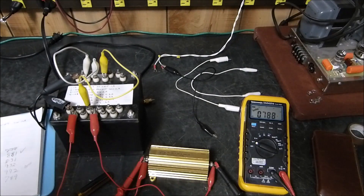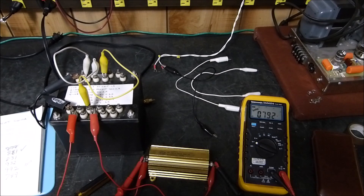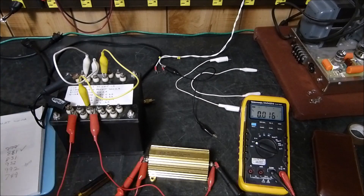Absolutely amazing. I did not know I could raise the voltage — I knew I could drop it. I've even got another six volt winding I can put in there and it just continues. I'd like to know why. I'd like to know if this is sustainable. Can you wire it like this permanently? The secondary winding getting in series with the primary obviously adds more turns to the primary, which changes the turns ratio to the high voltage secondary. But how does it go up? It's like magic.